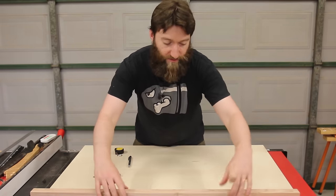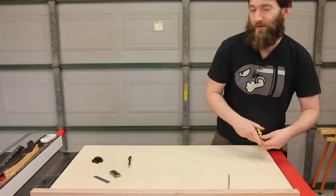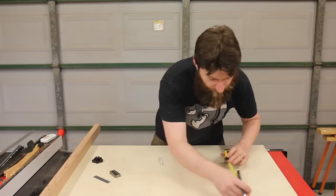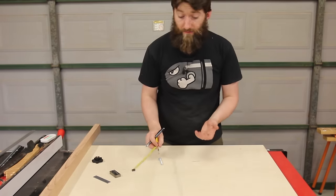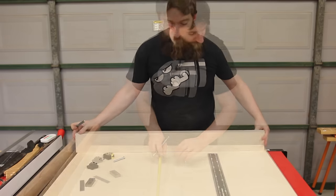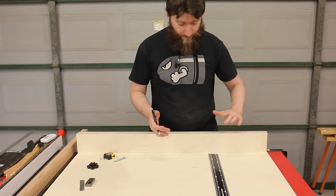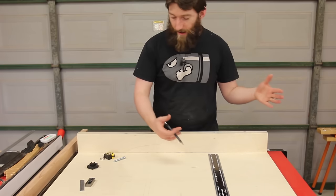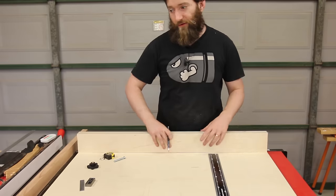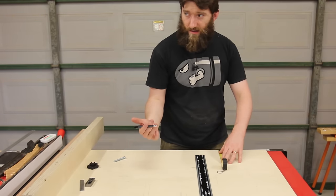With our fence position in mind, we can place a bolt not too close to the edge — I'm going to say 120mm. The accessories I've got in mind don't require symmetry, though if you've got something in mind you can make it as symmetrical as you like. Likewise at the front of the sled we're going to have a fence made out of three laminations of birch ply. So I can make sure it's going to be at least 36mm from the front, though we can go a little bit further. If you're going to have a hold-down, just make it a little bit longer and it's going to hold just fine. From the front I'm going to make that 120mm, which will be roughly 5 inches.